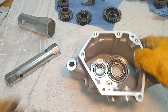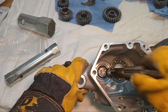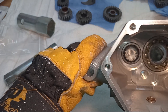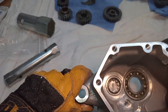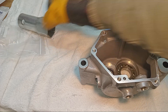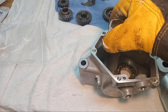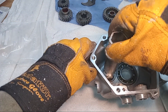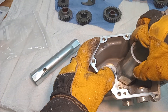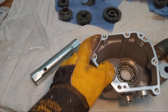The main thing is to hammer on the outer ring of the bearing, not on the inner ring — and in the case of the layshaft, not on the actual rollers. You can see we've got rollers on the left as opposed to ball bearings on the right. I used two box spanners which were just the right diameter — big enough to go on the outer ring but small enough not to hit the casing. You never want to hammer on the inner ring.